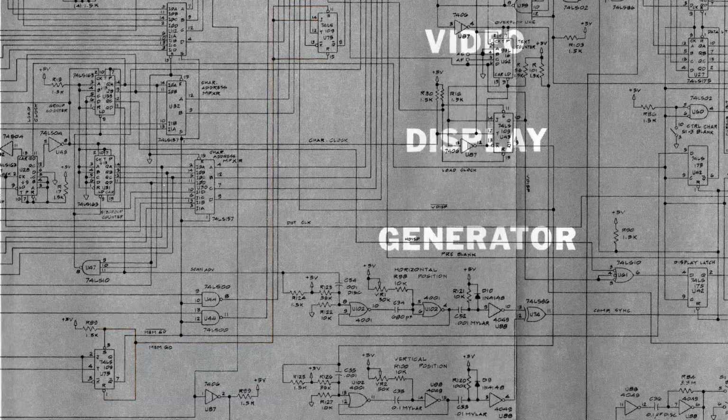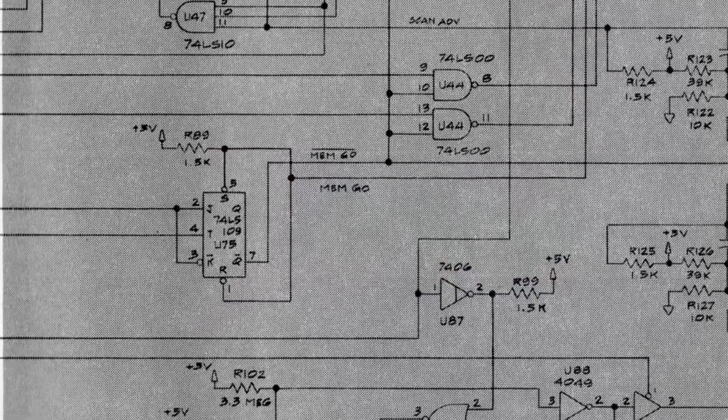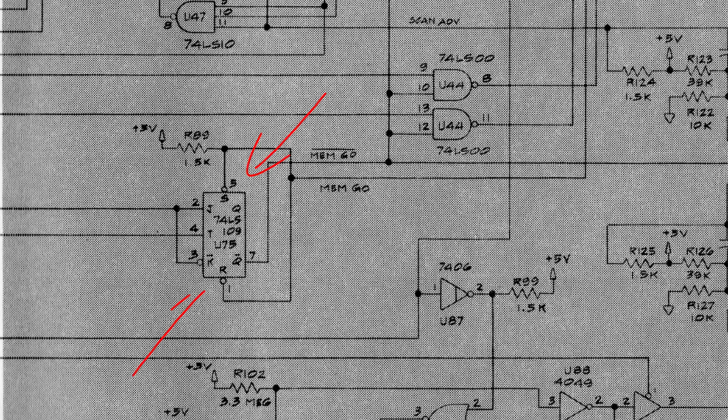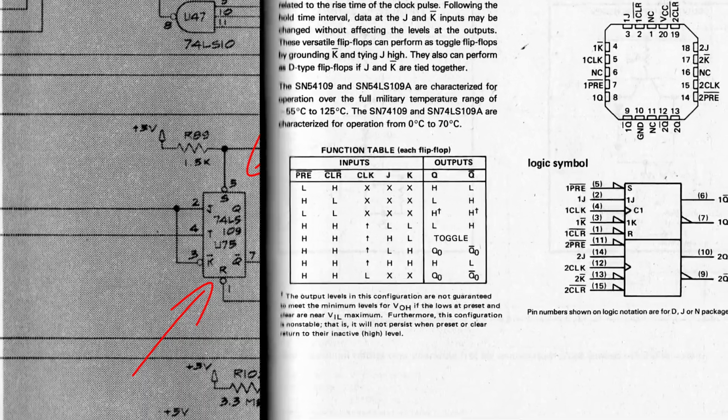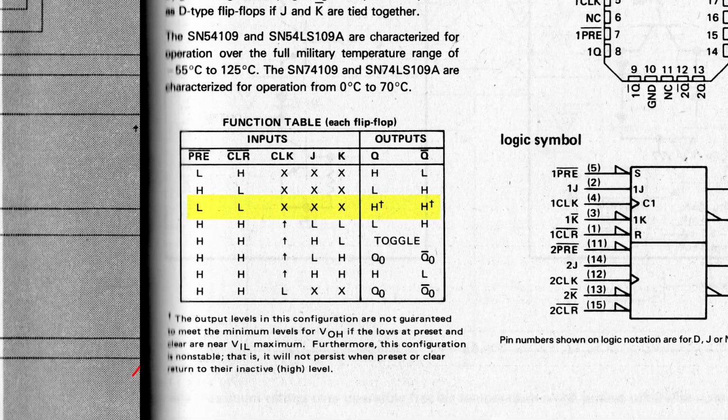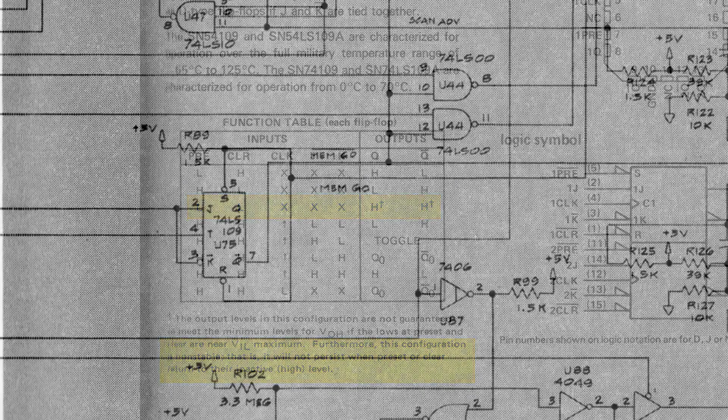And this is particularly true for latches, where here they're taking both the set and the clear, they have those together, and so if you were to do diagnostics on those and you were to jump them forced low at the same time, it results in the unusual condition that both the Q output and the Q bar output will go to logic 1. And that's a nice trick, but generally it's not all that useful, and it's a bit dangerous since you never know how the Q and Q bar outputs will land when that set and reset are released.